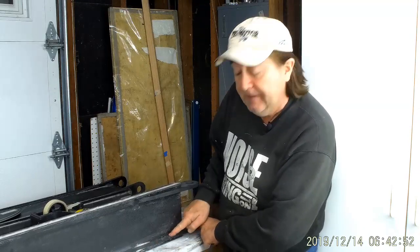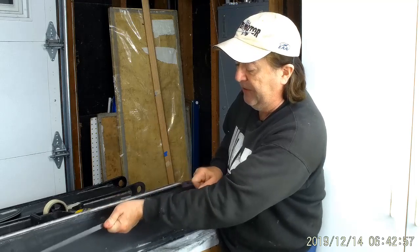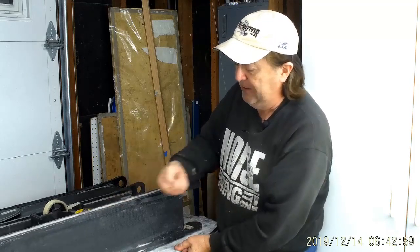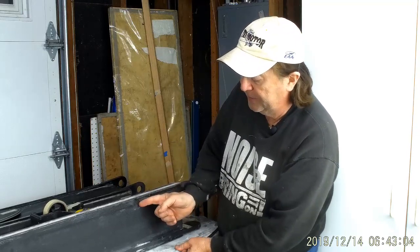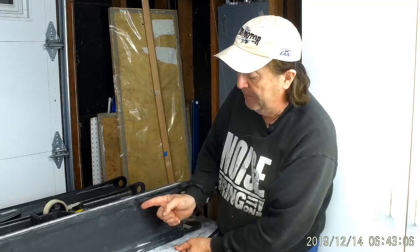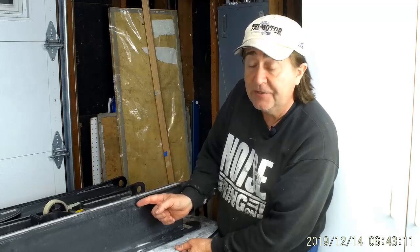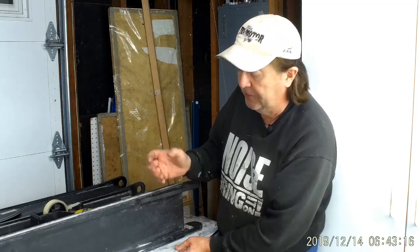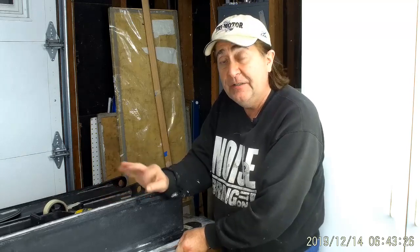When you put tension on this strap, you put tension on it this way, when there's a kink in it, it wants to straighten out. So there's a load going this way when you put it under tension. And that's a lifting load from the bond line where it's bonded down here. And that means that that bond line is being put in tension initially. It starts out as tension. If it were to pop loose, then it's in a peeling motion, a combination of tension and peel, which is very bad. Epoxies do not do well in peel at all. Very, very low strength that way. So we want to avoid peeling whenever possible. And in tension, they do so-so.